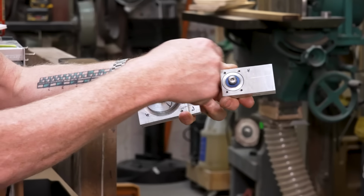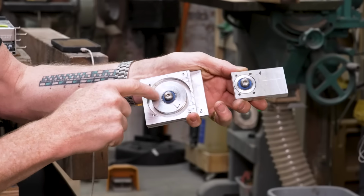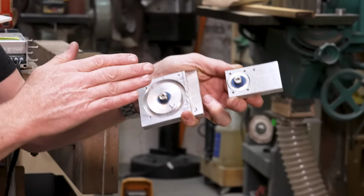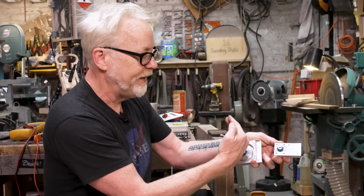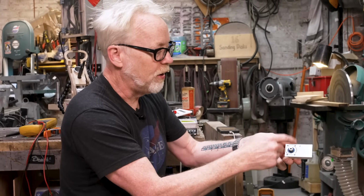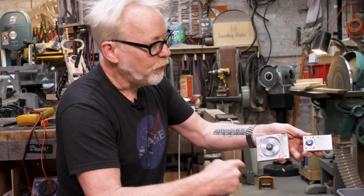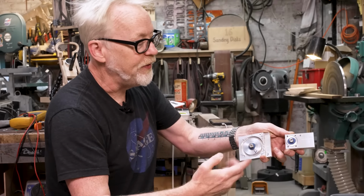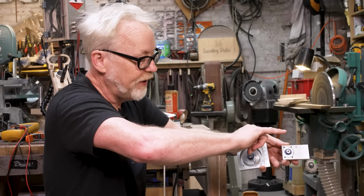this is a pulley on the jaw, and this is a pulley where I'm activating. And the reason the activation pulley is bigger is because I was hoping to transfer a little more movement to the jaw mechanism, right? Because I get a longer lever arm out of it than this one. And the goal was that there'd be a cable running basically all the way around the system. It's called a push-pull system. So I push here and it pulls there and vice versa.